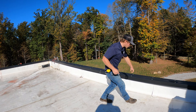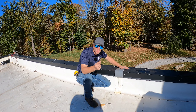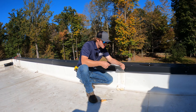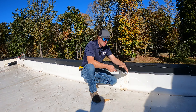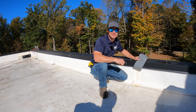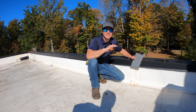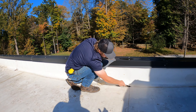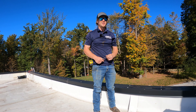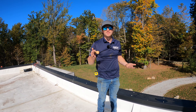When I ripped this patch up — come in real close — if the glue comes off and it's a clear or yellow glue, there's something wrong. This is reinforced TPO, and reinforced TPO can only be welded. There's no other way to do it; there's no peel-and-stick membrane that can waterproof itself to itself. I'm surprised they got it to not leak for three years — it's outrageous how much money they spent on this building. The only thing we can do at this point is replace the roof, because I can't weld to dirty TPO and guarantee a seal. It's unfortunate, but there is no other option.